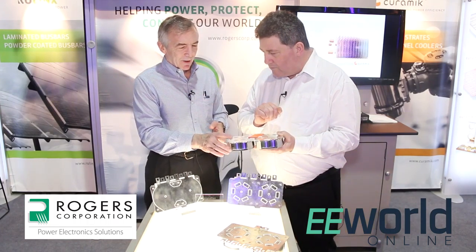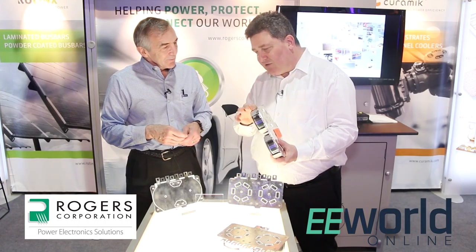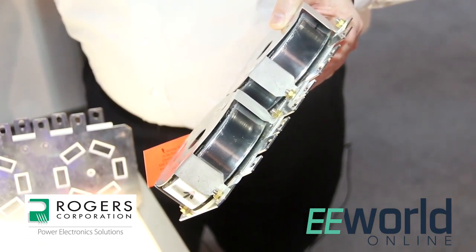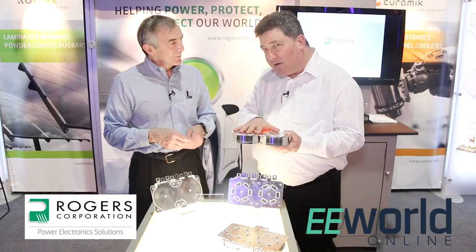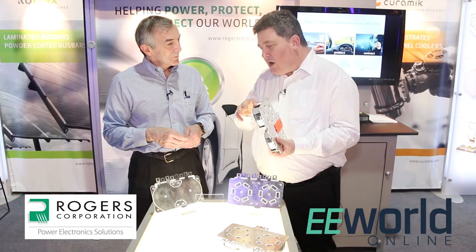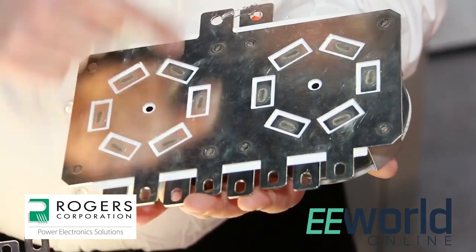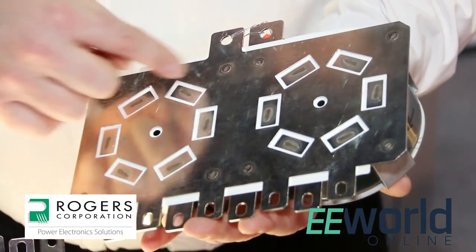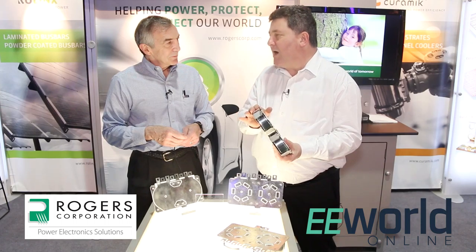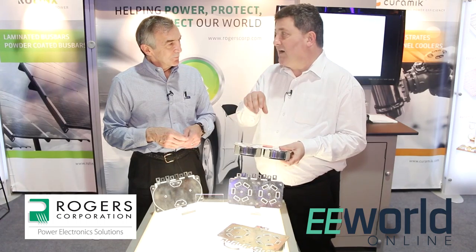How small of a capacitor will this work on? SBE has two sizes — this size of core and one which is about half the size. Everything we do is custom made; we can really tailor this to the application and form factor the customer wants. These capacitors come in a round puck format, a bit like an ice hockey puck. It's really the low height that creates low internal losses, giving extremely high power density — about double what you would get with normal can-size capacitors.